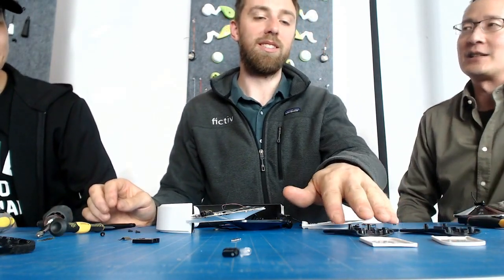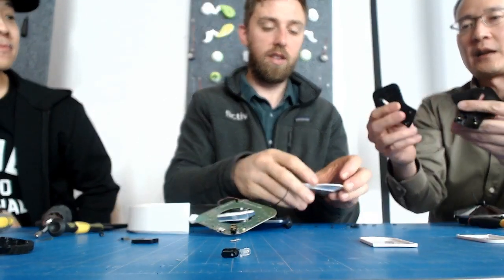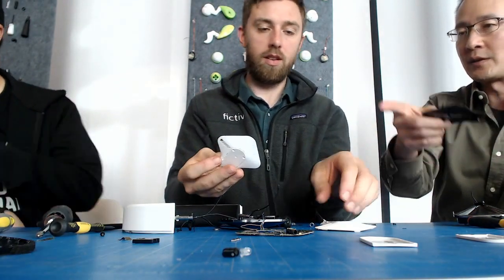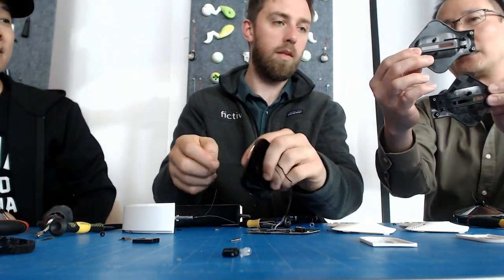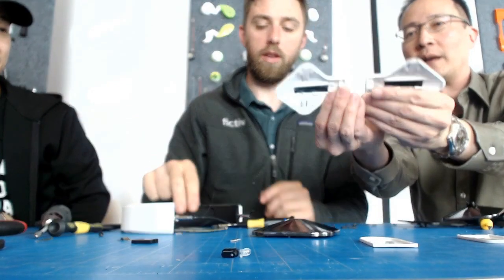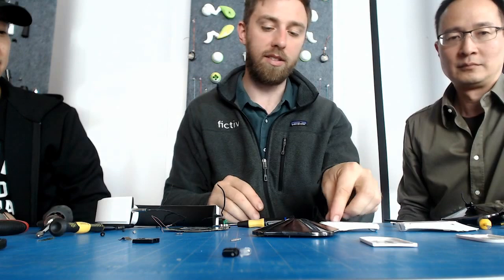So they could have been, this is a family tool. It's a family tool. Maybe help describe what a family tool is for folks out there. Because a lot of times suppliers match tools to the quantities per unit, so because there's mostly one of the headbands, but two of everything in the ear cups, these two parts are molded together, I believe, actually maybe end to end this way in one mold base. Yeah. And same thing with these two guys. Yeah, they'll be molded together. And a lot of times we do that for consistency and color too, so that they're shot together. You can imagine that if these are different, you might have a different mix for your black ABS.